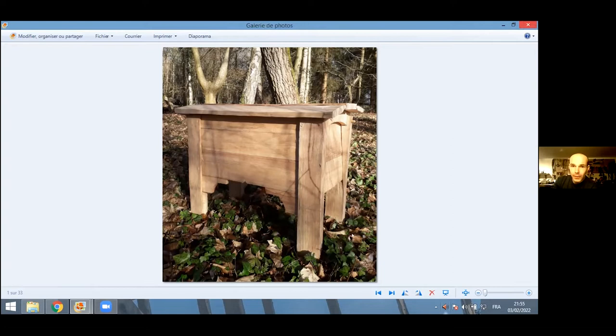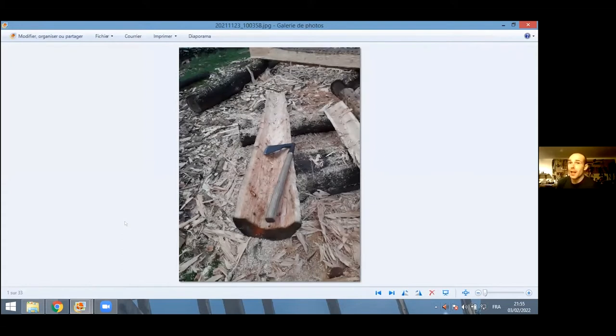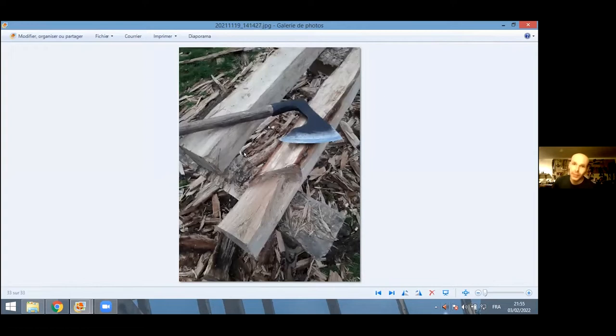Some other interesting things: being able to make gutters with axes — because I don't like the adze, so I use an axe instead, it's always a lot better. The key thing to be able to use the axe for everyday work is to think about your building in a different way. You need to eliminate as much as possible all the joinery that's going to be annoying to make with only an axe. Once you get rid of those, it's basically playtime all the time.